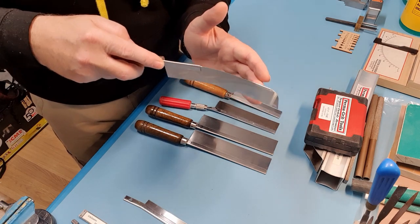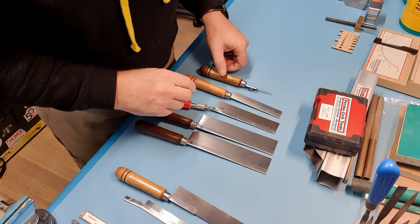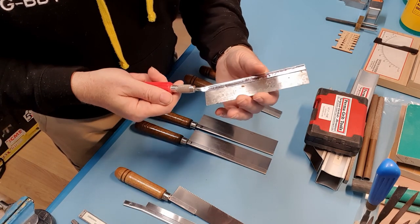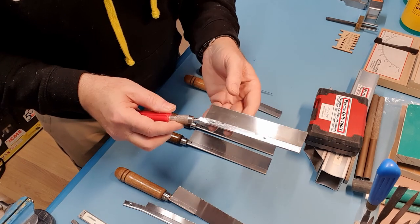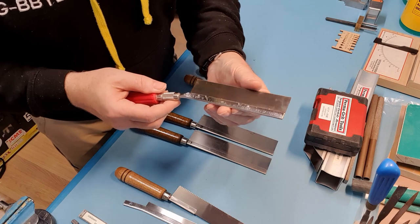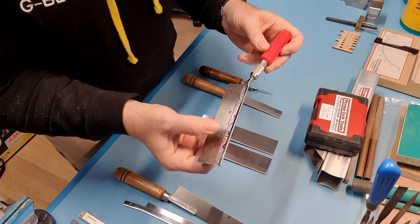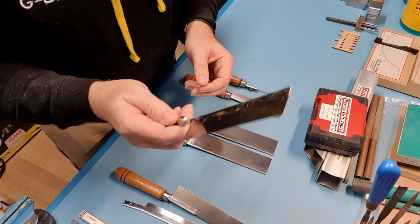Then there's another cheap blade, a little more expensive than the first, with a very fine cut — good general-purpose blades. Not very expensive, so I buy quite a few. As soon as they lose their edge I write 'glass only' on them and dedicate them to cutting fibreglass, carbon — anything that's really bad on your blades.